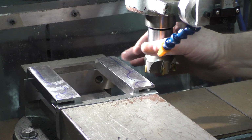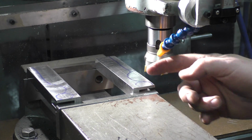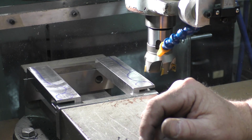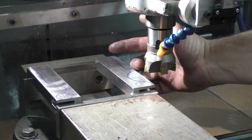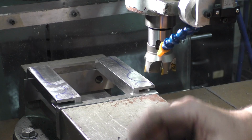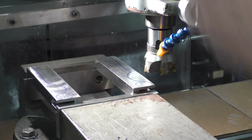So we're gonna take this little 2-inch cutting head and go up to this part here, back and forth a few times, and go right down to the bottom. And there's a few other processes I have to take off. A little more off here, up to 1/2 inch. And then drill the holes for the main rods that hold to the main chassis. So let's get on with it.